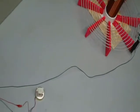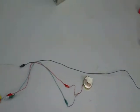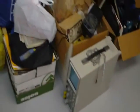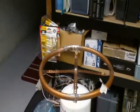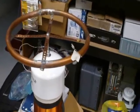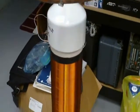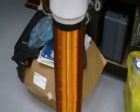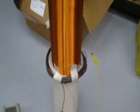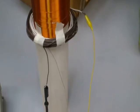That's the motor going — it's attached to the receiving end of the coil. And that's the receiver right there, our humble little toroid with a neon lamp. If you can see that, it'll glow once it resonates with the transmitter. That's our resonator, which would now be our primary on the receiving end — the primary coil.